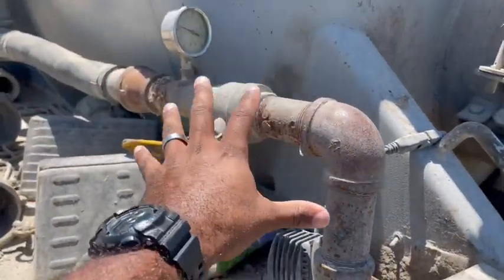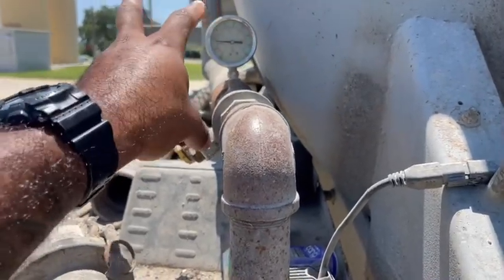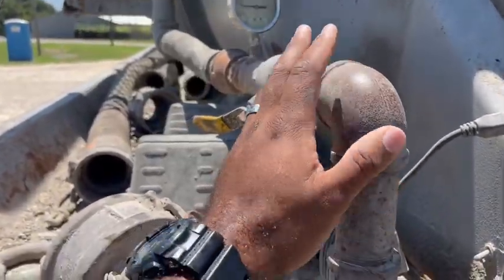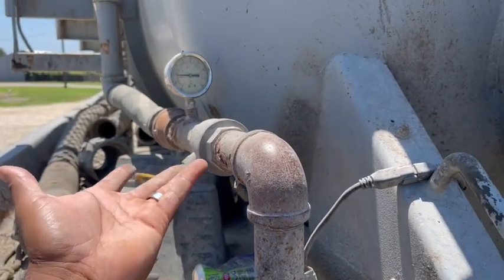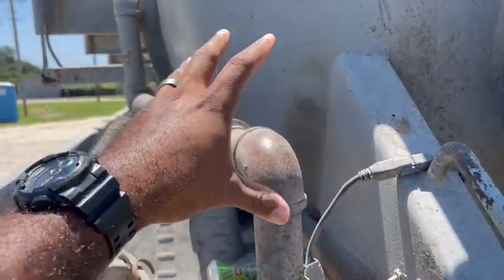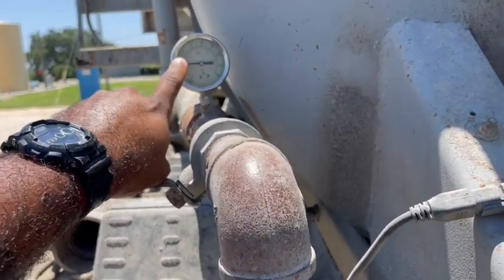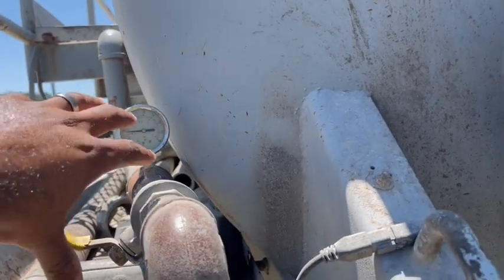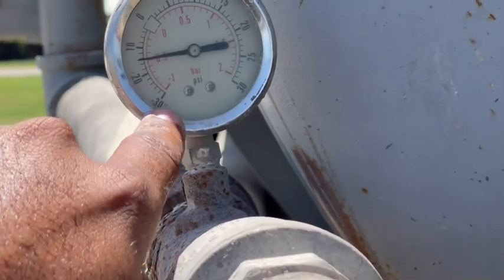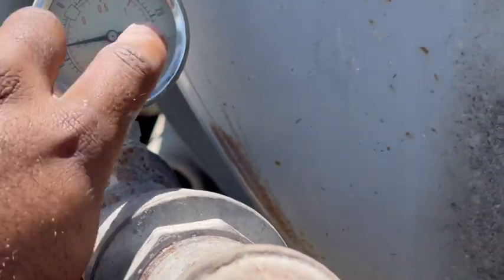Right here is the main part that plays in your loading and unloading. We have a pressure gauge — it should be on zero but it's a little off, which you'll see with old trailers. This is what you call a vent line. Every trailer is going to have a vent line. You always want to make sure it's open so that if there's vacuum or pressure on the trailer, you're able to release it. When I close that valve, this gauge is going to start moving into the negative side because it's building suction.